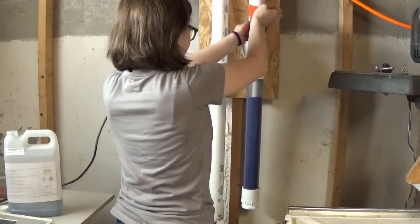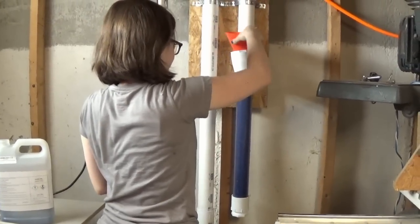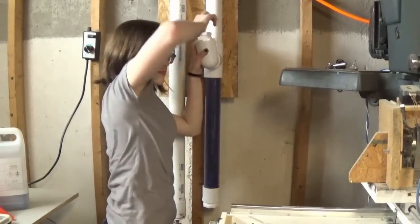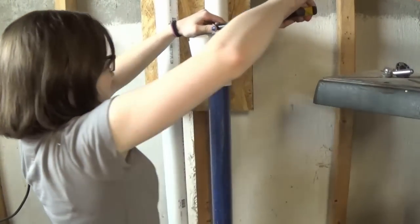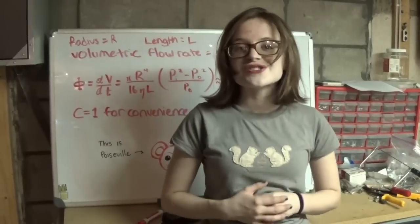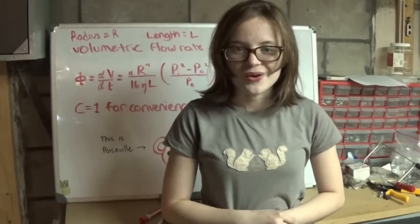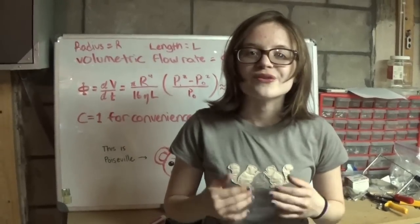Another question that has come up is whether or not you could use different diameters or lengths of tubing, and the answer again is yes. I've had absolutely no hint of air flow restriction or any hint of water, so I'm guessing you have wiggle room if you want to use smaller components. If you do change the size, remember that it has two goals: first, to optimize air flow; second, to allow the air to be in contact with the desiccant for as long as possible.